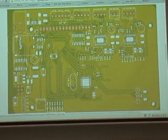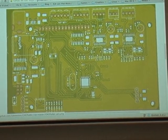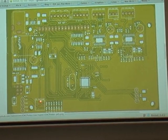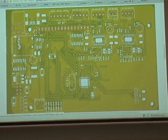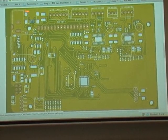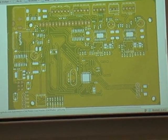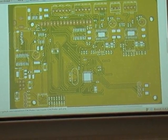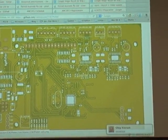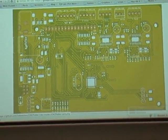As I was saying, there's the power supply with a 5 volt output and 5 volt rail, and the SPI programming interface for the AVR. That's pretty much it. Oh, there are some LEDs down here too, and an LCD contrast trim pot. And the switches on top. There's a spare set of pads up the top there for XYZ home position setting switches or limit switches, so that the machine can set its home position. Also an E-stop. They're just digital lines with a pull up.